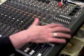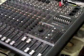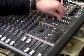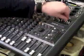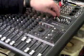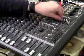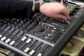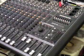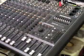This has a 9-band graphic EQ, graphic meaning that when you adjust all these, you can see a curve shape or whatever, you can see that sort of squiggle. In the center position there's a little detent, so they click into place. That's flat, that's EQ flat. This is the EQ for the entire desk, for the overall main mix.